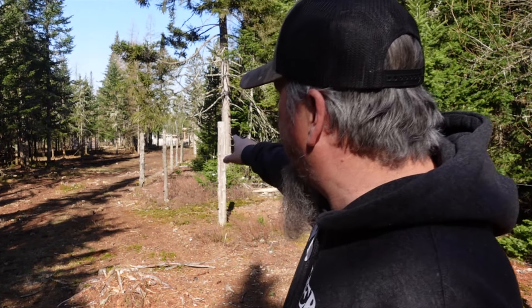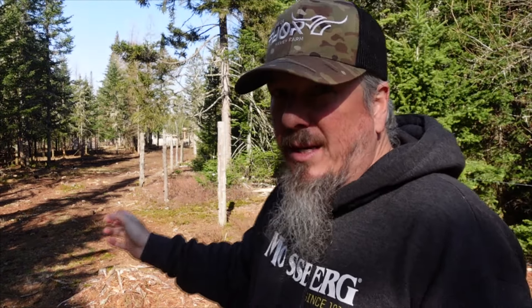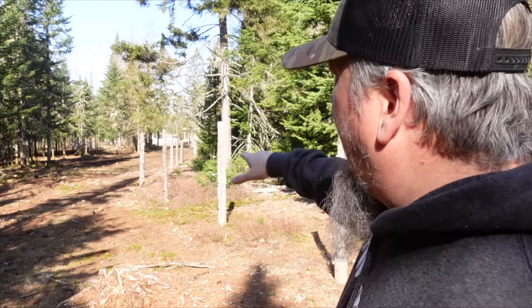As you can see, the fence line behind me is not straight. We should have cleared extra trees or made a little extra trail, or just given up that extra space and gone straight from end to end. What's happened is the wire has popped off at one of the curves, and further along it's popped off again where the fence curves back in. The wire has popped off the insulators a couple of times and pulled some insulators out of the wood due to the pressure. On one corner post, the wire has actually torn into the insulator and we've had to replace insulators a couple of times because every time we tighten the wire it cuts further into the plastic.